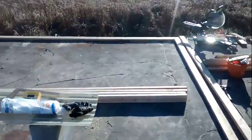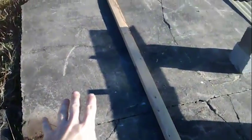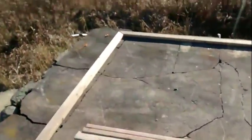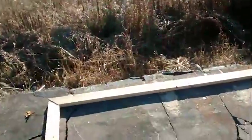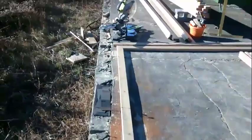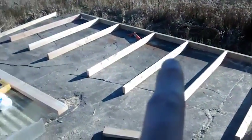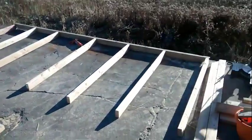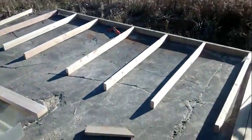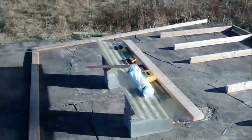Greenhouse base laid out — 12 foot by 12 foot. Some room on the back of the pad here. This is the north-facing side; the sun's that way. We have a little drop-off here, so I want this fairly close to the edge so not much snow can really accumulate. We're going to use construction adhesive in the joints and then screw it together with 3-inch deck screws, so that will be a very strong joint. Then we're going to get the other sides made up, get them all put vertically, and start framing up the roof.